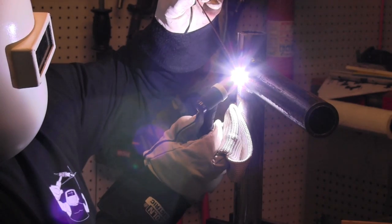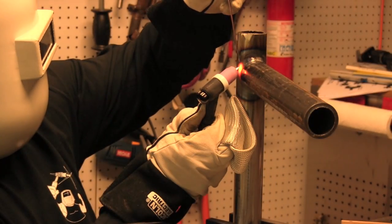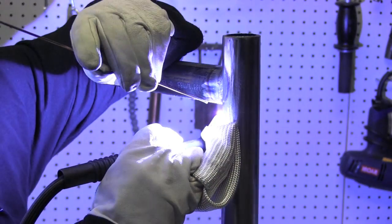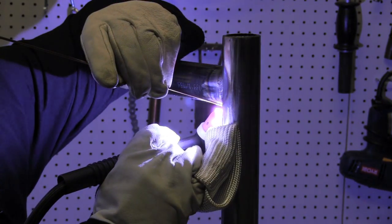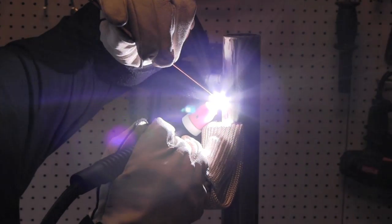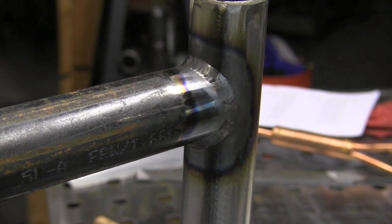I'm using the lay wire method here — just leaving that 3/32 inch wire in the puddle as I weave over it. I'm using a TIG finger, which keeps my fingers nice and cool so I can concentrate on what I'm doing instead of how bad my knuckles are burning. I'm holding the torch a little different here, kind of upside down, because that just seems comfortable for this side. Propping with the TIG finger on my pinky. And that is the finished weld — two passes on that joint right there.